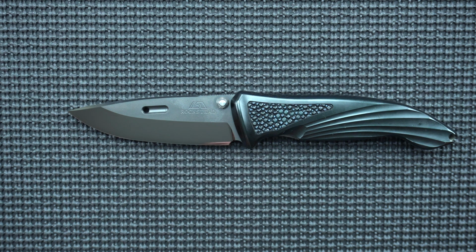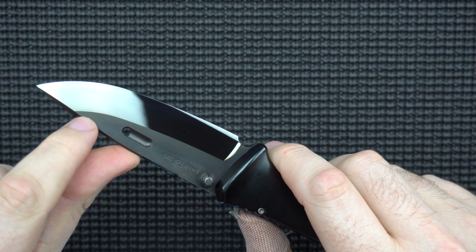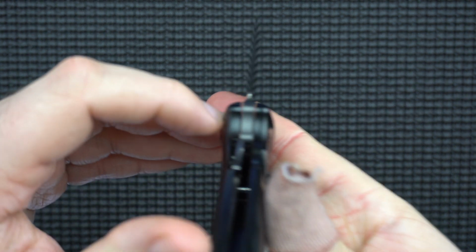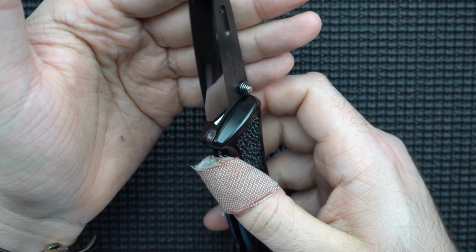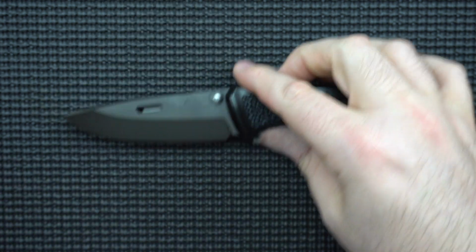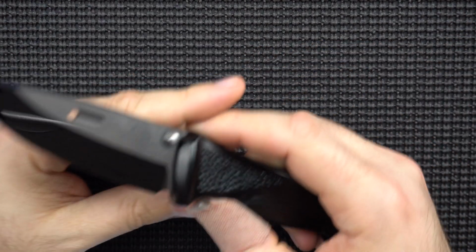My next excellent part of the blade that I like a lot is the grind. So there are kind of two things going on, and both, when combined, are one of my favorite blade grinds. It's a Scandinavian grind. It's not like a full flat or anything like that, but it's also a convex grind. So the blade, I don't know how well you can see this, it's going to come to a point, and there's no secondary bevel or anything like that. It's just one convex to the apex of the knife on each side. I think the slang for this would be a Scandivex. It's a convex grind, it's a Scandi grind, Scandivex, or to really confuse a Scandinavian person.